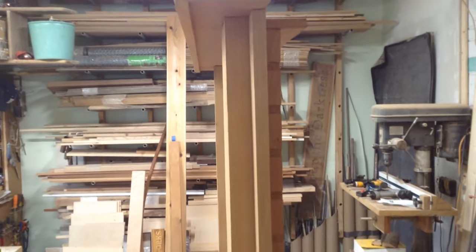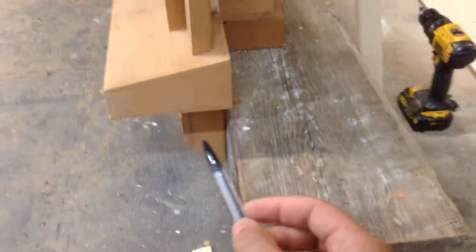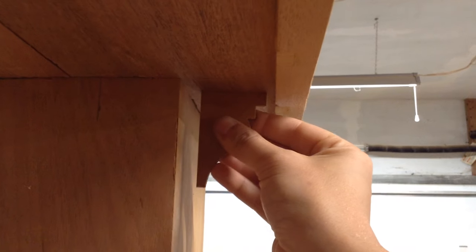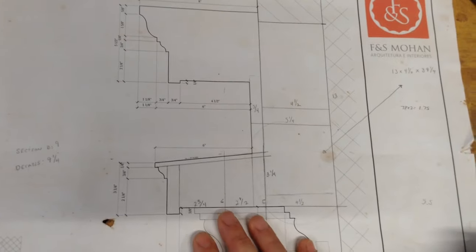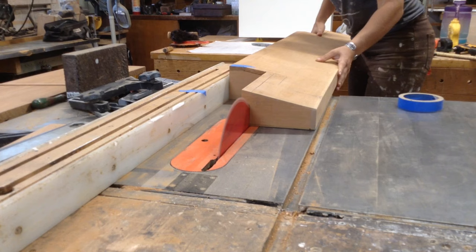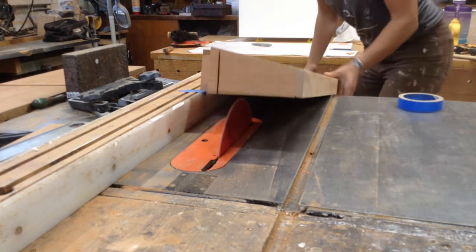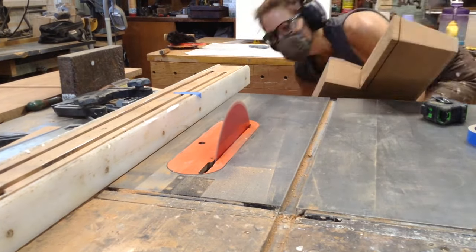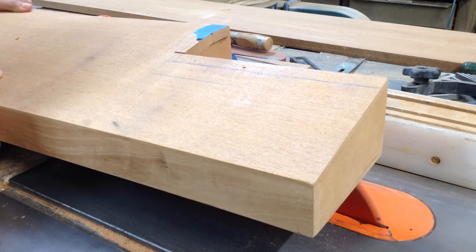But then the problem came when I was working on my moldings. The moldings were going to overhang, and what I had done to make up for the original dimension mistake was move the sill forward — so the sill was three-quarters inch forward. I was going to put a shim in the back since that would be covered by the mosaic. But this pilaster is going to get a half-inch piece of molding, and by the time I put that on, my trim would be way too far forward — it wouldn't even be close to accurate, and it would mess up the arch. What I had to do was trim three-quarters of an inch off the sill ledge. Instead of a six-inch overhang it would be five and a quarter — not a visible difference, but it would solve all my problems.